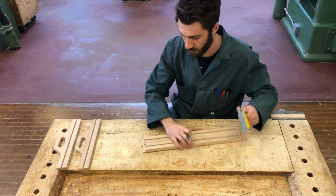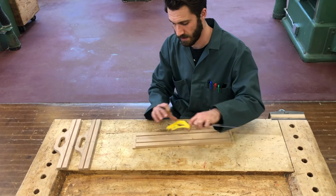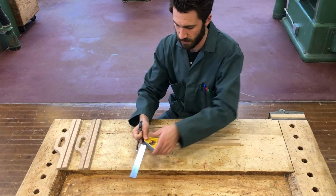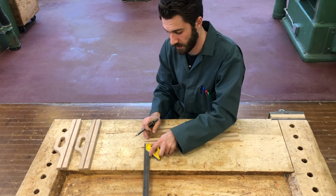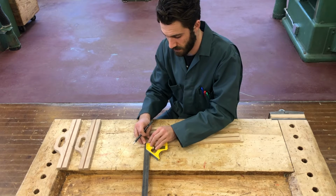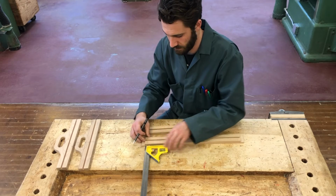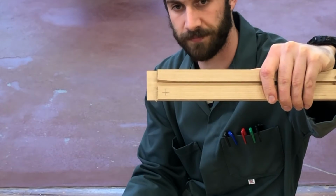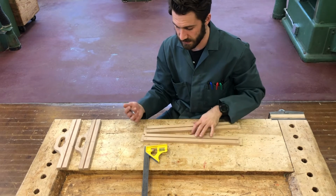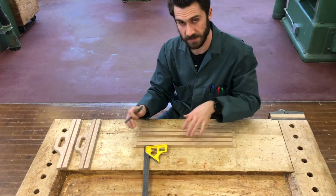And now I'm going to do a very similar motion. Again, you need to know which side the bottoms are, but we are going to put the mark of our crosshairs where we'll plan on drilling. So we take it to our line that we just drew at 12 millimeters, and we will be marking our side piece like so. Do that to all 4 pieces, and then we will indent those with an awl for our center punch mark.